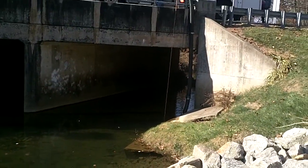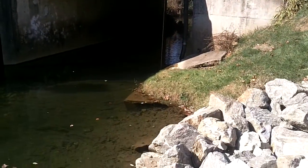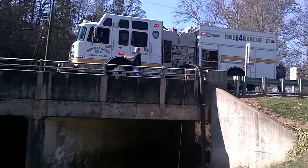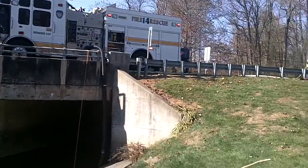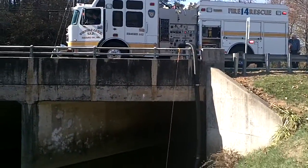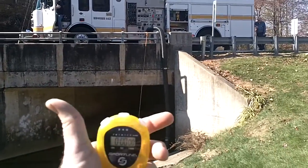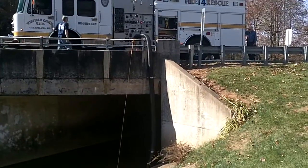We have three lengths of six-inch hard sleeve coming off of this bridge down to a box strainer in the stream. Driver operator is Scott Dayhoff. He is going to engage the pump, run it up to a thousand RPMs. It's a 1,500 gallon per minute pumper using six-inch hard sleeve, and once he hits that auto prime we're going to start a timer and see what it takes to get this thing primed.